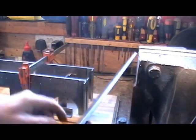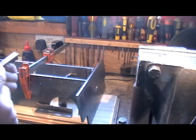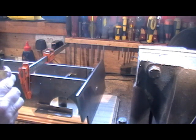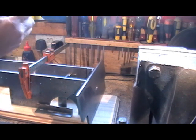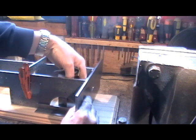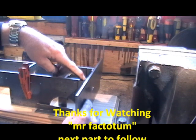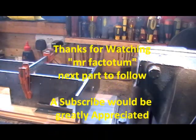Just another little reminder: when you've cut your angle, if you're cutting it from hot-rolled angle, no doubt it won't be square, so you'll have to skim it up. You can either do that on your milling machine, put your milling attachment in your lathe, or if you're good with a file you can square them up that way. But they must be square on that profile so that everything fits up nicely to the frame and buffer beam. And again, remember to leave the amount of the footplate thickness so your buffer beam stands proud - I won't forget that this time.